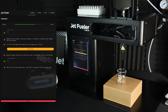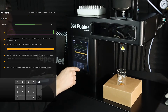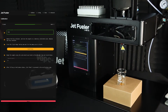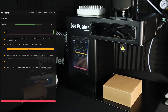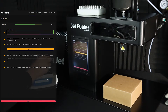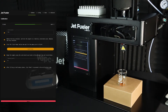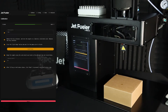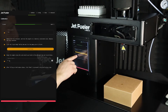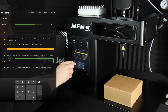Here, I want to enter my desired weight in grams at the top. I will put in 1.0 grams. Now I want to remove the drip container and tare its weight using a lab scale. Once tared, I can replace the beaker underneath the needle and click the cycle pump button. Now I want to weigh this sample using the same scale which was tared in the previous step, and we will enter the dispensed weight here: 1.07.